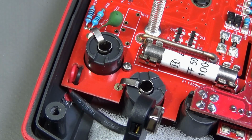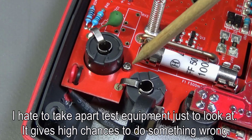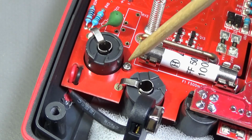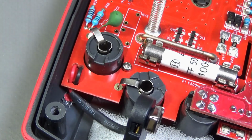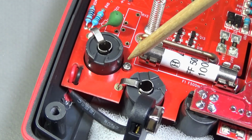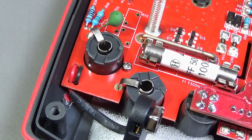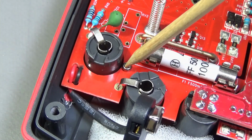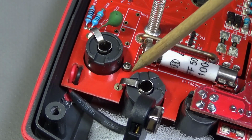Where do I find the real issue? It's very simple. I told you guys I don't like to take off parts. Any screw in a factory is placed with some special calibrated force. The screwdriver has a force and is under a calibration process. If I remove this screw, next time I screw it, probably I can tighten too much and crack the copper on the barrel or the track. Or I cannot put it tight enough, where this screw will not be part of the bridge conduction. Got it? So it was right until it was done. It will be wrong the day that I remove it.